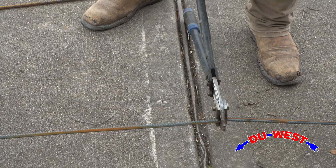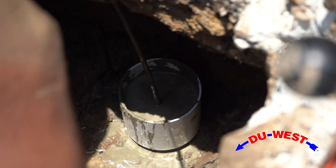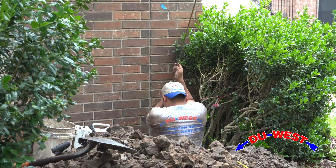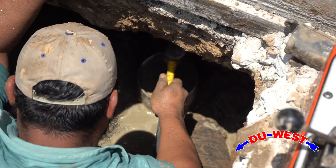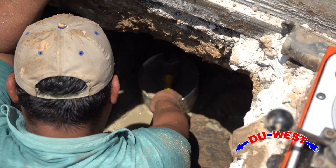After the pile is driven all the way, cut your rebar, and you're going to set a little plastic cap over the pile, fill it with the mud, and then pull your rebar down through that hole and tap it down into place. That grouts and seals so you're not continuously getting water in the bottom.